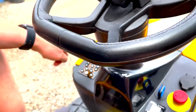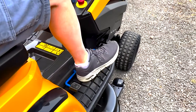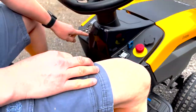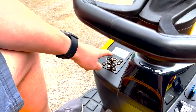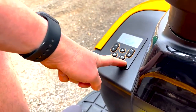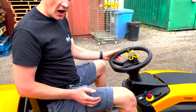Here's what that means in practice. Start the blades and drive forwards — that works fine. But if you try to go backwards, you'll hear a beep and everything cuts out. That's because to cut in the reverse direction you have to press the deliberate reverse switch. So switch it on, the blades start, then press and hold this button, and then when you press on the pedal you're good — then let go.